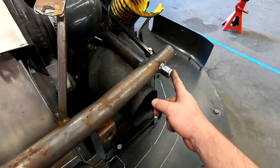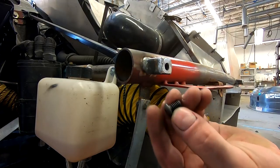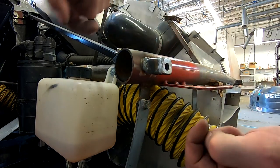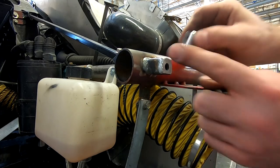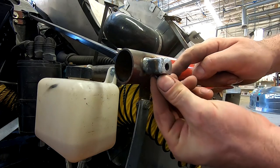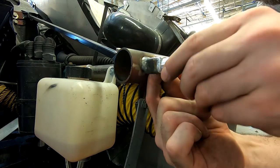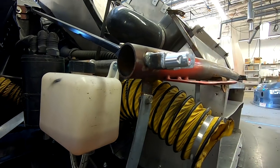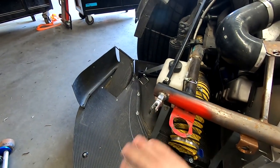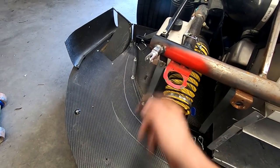Here you can see our finished mounting lug. I'll paint them real quick. The hardware that comes with it I wanted to reuse — I could have done a bolt from the rear through the whole thing, but since this tube is rounded it could have made it pivot or not be as strong. That's why I wanted to just weld a lug onto it. The bolt comes in from the back side and then these clevises are threaded. I'm going to modify an allen wrench short enough to get behind there to hold it and tighten it down.